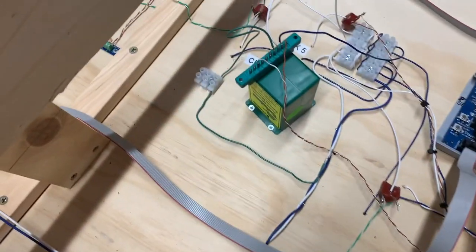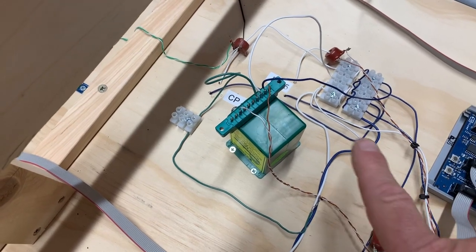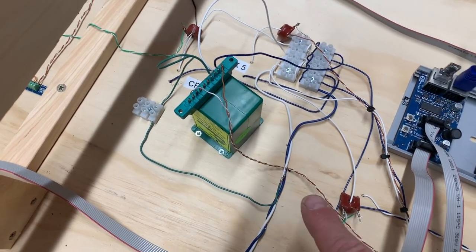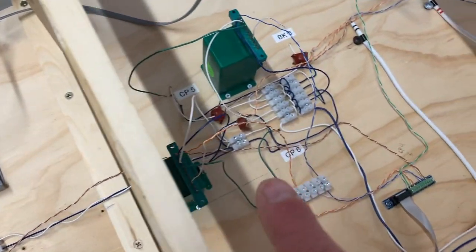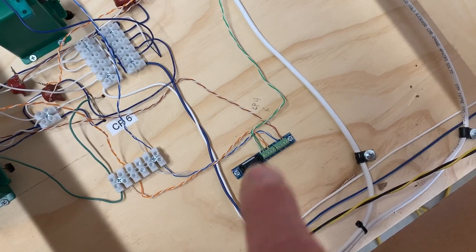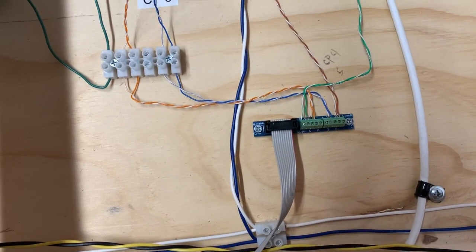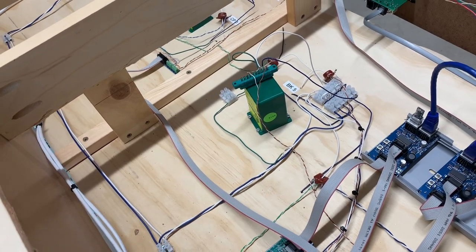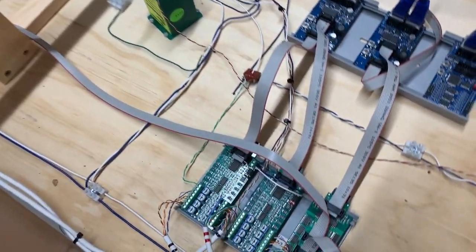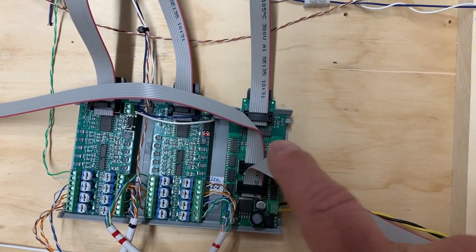And of course I had this issue here with that edge connector. So I've got this wire going way over here to that breakout board so that I'm making use of channel 5 with CP4. That was because I lost channel 4 in my stall motor driver.